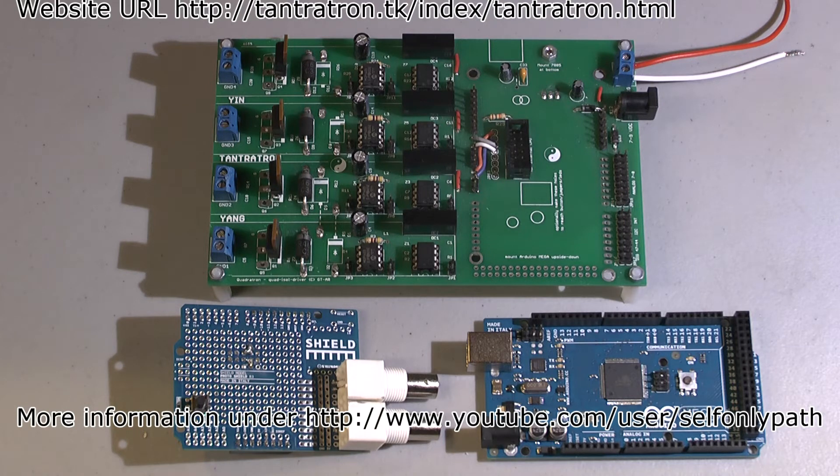You see below two modules — one is a board module from Arduino, the Arduino Mega 2560. Next to it you see the Protoshield I built with two input ports for the signal generator I am using. Here on this board you can see I've already mounted IGBT chips, and this IGBT chip does not have a freewheel diode, so you add the diode externally to allow recovery time — very fast recovery time.